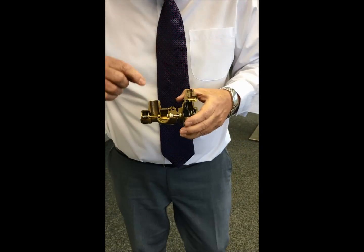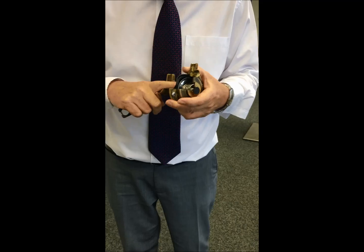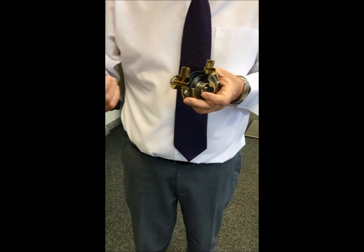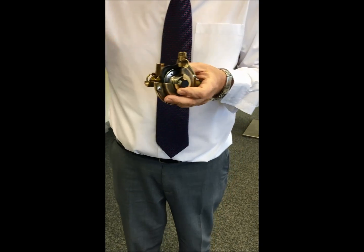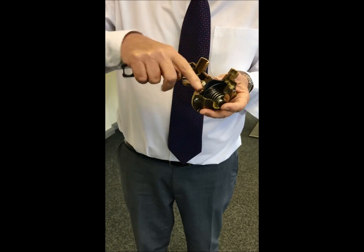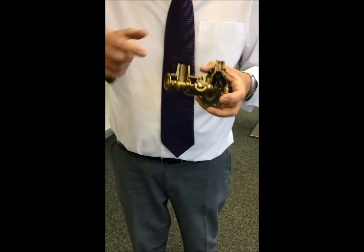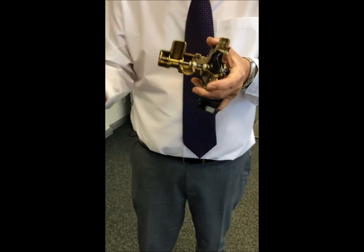Okay, now failures on this valve, as we know. One, we could have a pinprick in the butyl rubber diaphragm, so the customer says they have to open the hot tap maximum for it to fire. That's a pinprick. We can have a situation where the plunger's not moving at all, then there's a tear in that diaphragm. Okay, we can have a situation where the water's not performing. As I say, there's no ghosts.